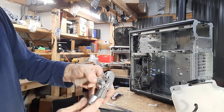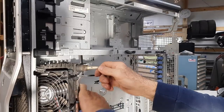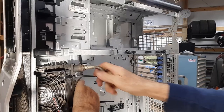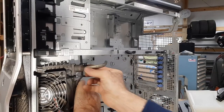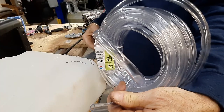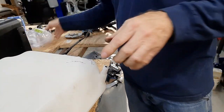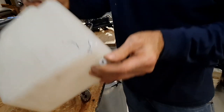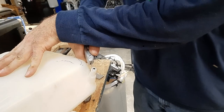Just a little score on there and snap that back in place. It used to hold transmission line pressure so it should hold this little bit of fluid pressure. I even got the safety clip, because you never know when vibration might cause that clip to fall out. And because I'm using three-eighths ID hose, it won't fit over that very easily without heating it and stretching it. I'm going to take a knife and cut this down a little so it's closer to the size I need, since it's actually way over half inch.